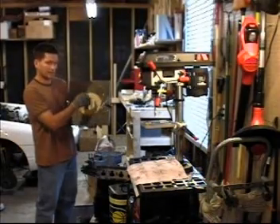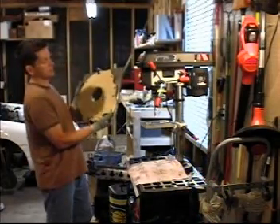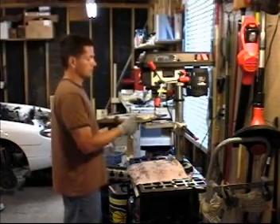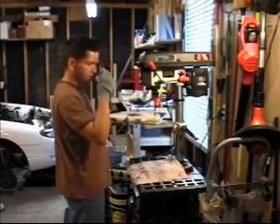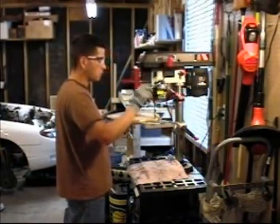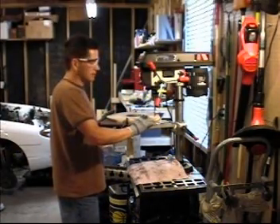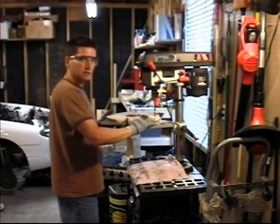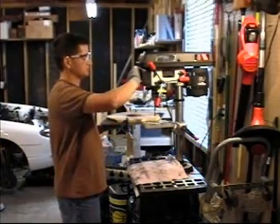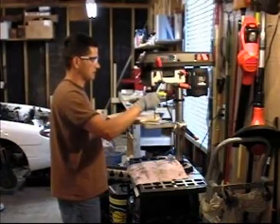This template is just the right size — all the holes are where they need to be. Now these bolting holes are not quite as important as the dowel pin holes. They need to be the right size, but they don't have to be within 0.001 of an inch or anything like that. These are not nearly as important; I can pretty much just whip these out and make sure it's right over the spot where it needs to be.